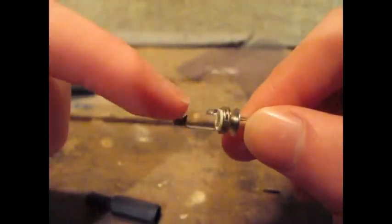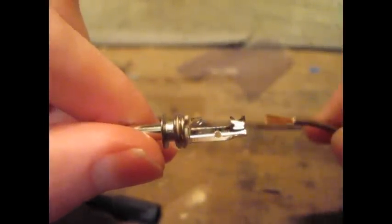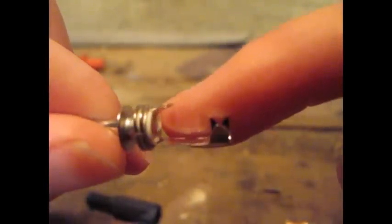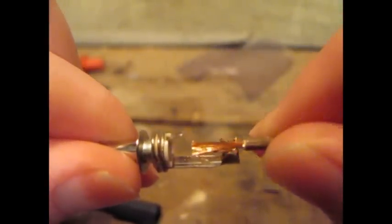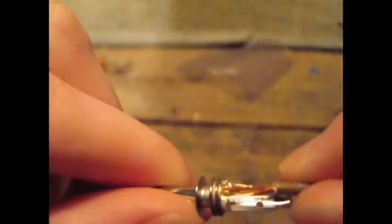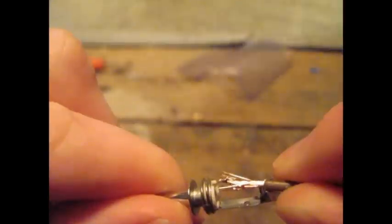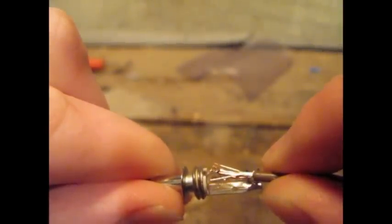We will be soldering our piece of copper wire to this smaller one here. Take the three and a half millimeter plug and the piece of stripped wire. If you just slightly fray out the ends of the wire, you might need to lift up the small connector here on the bottom just a little tiny bit, and just take your wire in here and try and very gently screw it in through the hole like this.